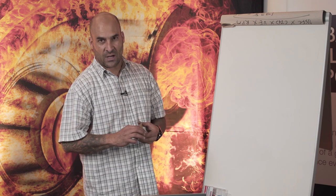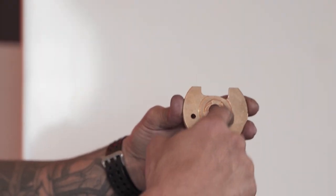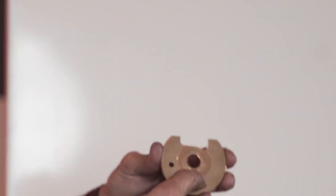Let me explain why. I know it's a long one and a tedious one, but there's a lot of information I'd like to share with you guys that's really, really relevant. And here's the last little piece before we close off. I'll come in for a landing. Now, on your thrust face, on your thrust bearing's face, you've got pads. Essentially the load in the compressor and or turbine direction, axially, gets distributed across the face of the thrust bearing on those pads.